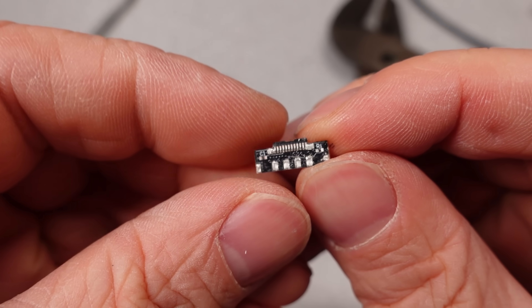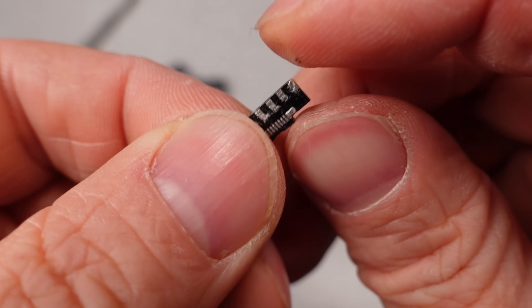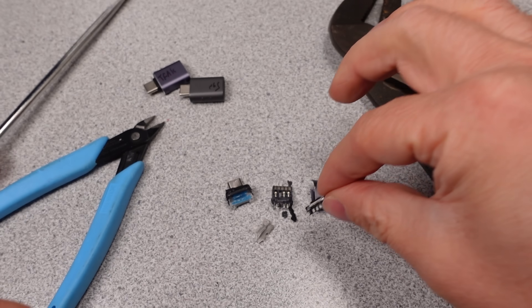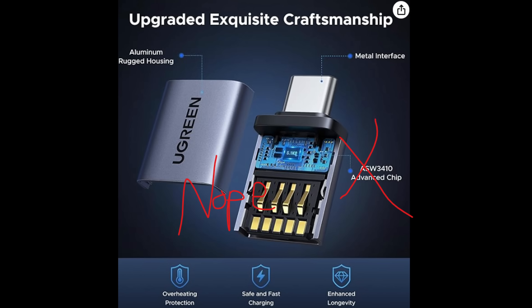From one of the CC lines on the USB-C male connector to the ground pin, and that's it. I don't see anything else here. It looks like there is a spot for a capacitor, but I don't know why that would get populated here. They do need to take some care with this tiny circuit board to make sure that signal integrity is maintained, as the USB protocol is pushing some fairly high data rates through these little things. The cheaper ones I'd imagine could have some issues with that. The claims on this Ugreen of a protocol chip are complete nonsense — just like the others, one resistor. The 6 amps and 120 watts of power on the orange one, also just a bunch of nonsense — again, one resistor.